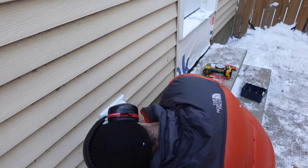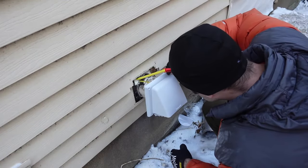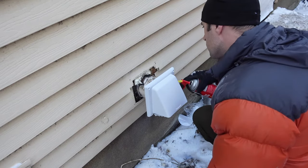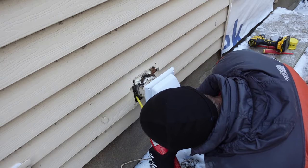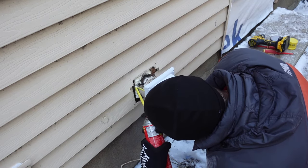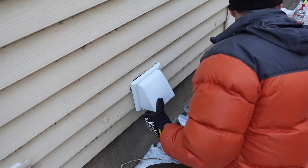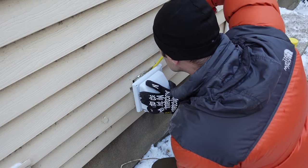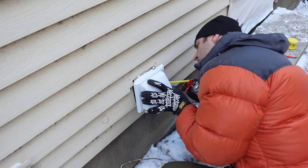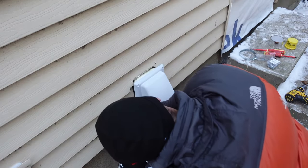You can see now with that small piece of vinyl siding removed it fits much flatter. One last dry fit and it looks good. Since I won't be able to get in there once I push the vent cover back in, I'm going to hit it with some spray foam. As soon as I slide it in, that spray foam is going to compress a little deeper, so I'll take another pass and get two layers around there. This should stop air leakage from around the vent.